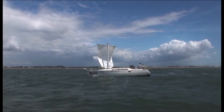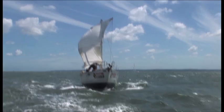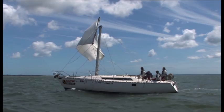We've got our jury rig set, which is a square sail. We're easily making better than 180 degrees between tacks, despite there being a little bit of slop here in the tow line. The important factor being that we can now make our way off of a lee shore. If we've got sea room, we've got time to do anything that we want to do. We can improve the rig. We can get away from things. We're not exactly in racing form at the moment, but we're making a fairly steady 2 knots. And in a good moment, we can get the apparent wind round to about 70 degrees.